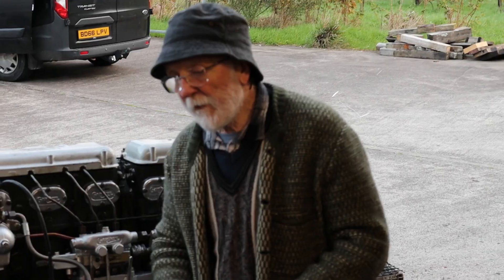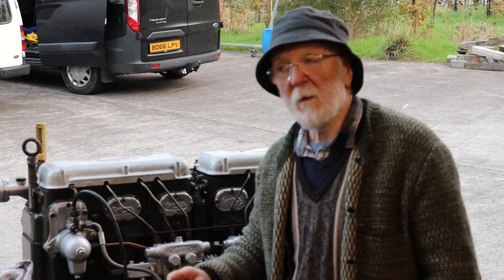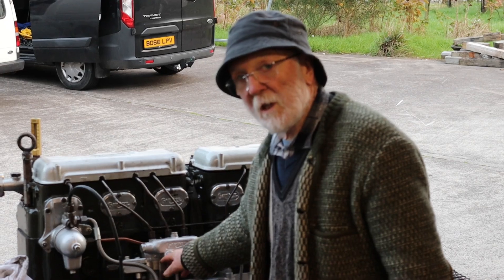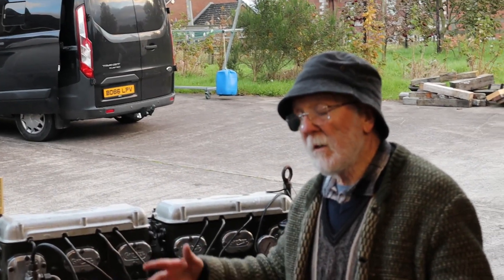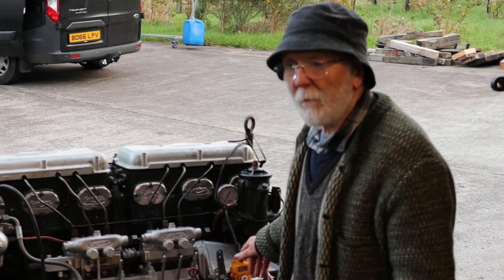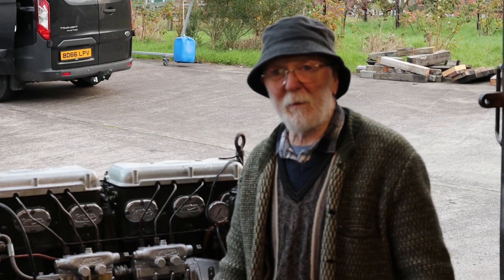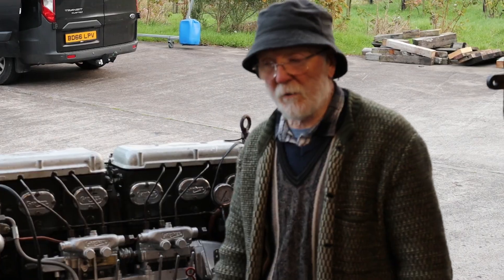We did that and found that number 1 was coming up to about 300 RPM. On the first phase it was only coming up to about 150. But with just one cylinder doing the work and the back block decompressed, she's coming up to 300 RPM. I repeat — whenever the engine's running on one or two cylinders, the only work it's doing is dragging the pistons around. There's no way we could connect a gearbox to it and ask it to drive a lorry under those circumstances — it's just not going to happen. All the energy is going into simply dragging those inactive pistons around.